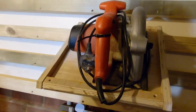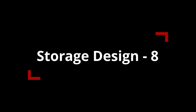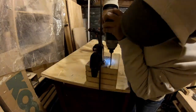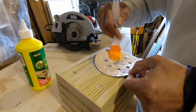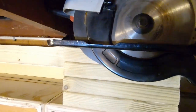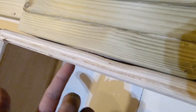Even though it looks nice and I've seen many YouTubers use this kind of system, for me personally I don't use the circular saw that often since I got the track saw. So this is version two of the circular saw stand. What I've done is taken four pieces of deck boards, chopped them into pieces, and made a big chunk like a butcher block. I used an old 40-grit sandpaper and glued it at the bottom — when you push it with a finger you can see it's not easy to move. If required, I can always screw it down from underneath as well.